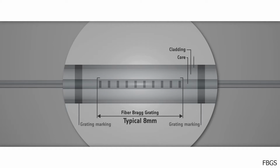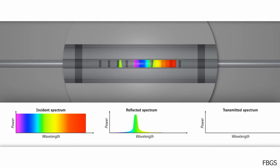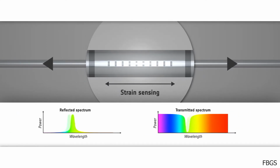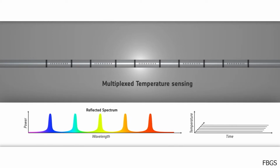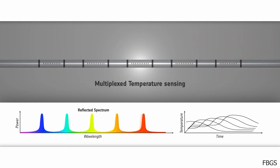Now, fiber optic sensors, we use these Fiber Bragg gratings that have etches in them, and if you go in closely, you can see that within the core of the fiber optic there are these evenly spaced etches, and as the light passes through, a certain amount is reflected back. And as that fiber Bragg grating contracts or expands, the wavelength changes as reflected back to the interrogator. So we use that to be able to monitor the strain changes on the web frames of the internal hull. And also we have to compensate for temperature as well, because these are also very sensitive to temperature.